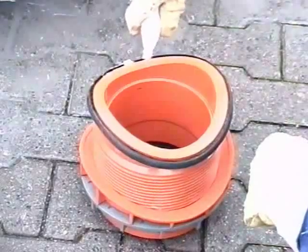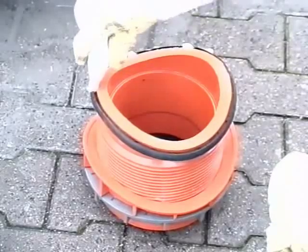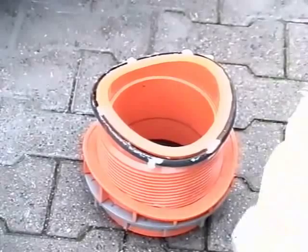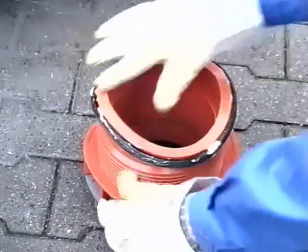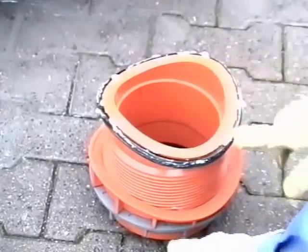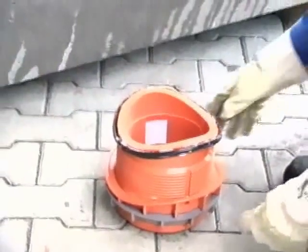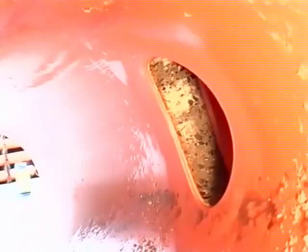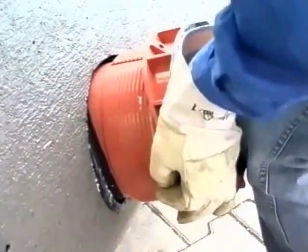Check the success of the work by hand. Now smear the elastomer seal with lubricant. Pushing the saddle into the opening will now give no problems if you have observed the previous instructions. Push the moulding into the bore so that it can be loosely pushed backwards and forwards. If you cannot achieve this state immediately, simply screw the nut upwards a little by turning it anticlockwise. Re-seat the saddle loosely.